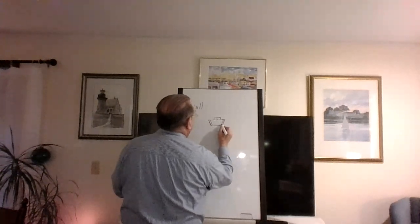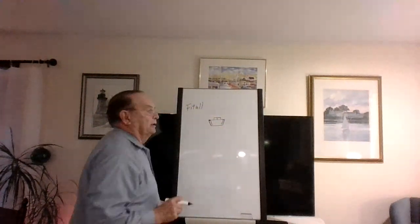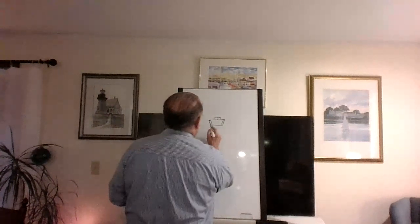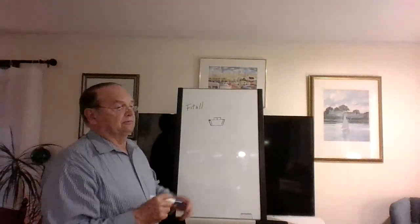You can't see this, of course, looking at it from the side, but if you look from above, you notice that this last bit here is all lead. Looking at it when it's installed, you can't tell. But if you have it in your hand, you can see the taper. And the reason for the taper is this. You have an old clean out, and the cover is missing.